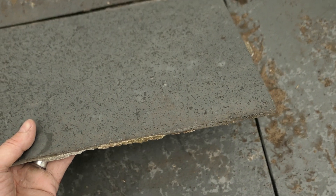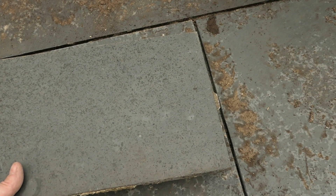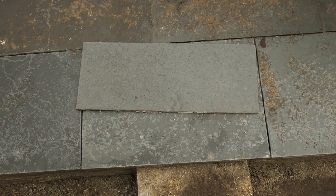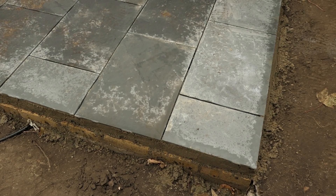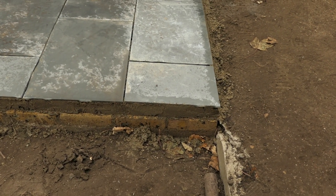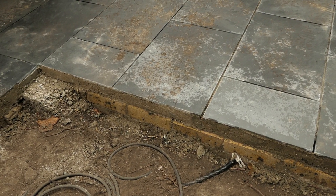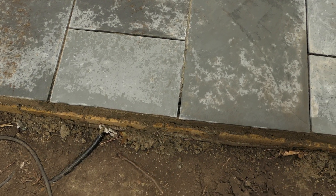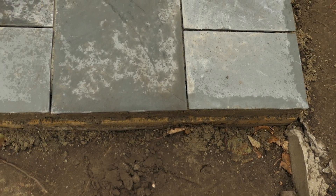You can see where I've taken the half slates off and replaced them with full size slates — this makes it look much neater. It will also look even better once it's all cleaned up and grouted. I've also cut these tiles in place here and made the edging nice and straight. This is where the decking will go — it will sit flush with the tiles at the same height. There's a slight lip where the bricks are out a bit but this will be fine to set the bearers against.